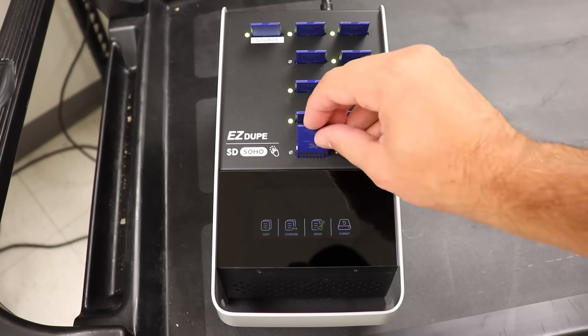My friend Derek at Stubby Nozzle Company turned me on to an SD card duplicator. You insert a master SD card with all of your print files, and with the touch of a button it duplicates the contents onto 10 SD cards. These things are not cheap, so if you have a small farm it's probably not worth it. But as soon as you have around 20-ish printers, it is well worth the money. You can also network your printers together and use software to control all of them from a central repository, though that's not my personal preference.